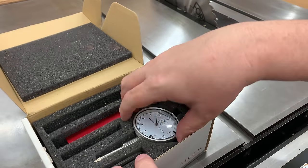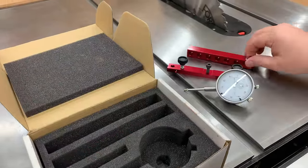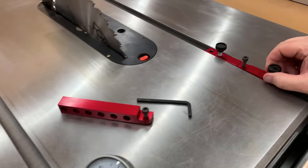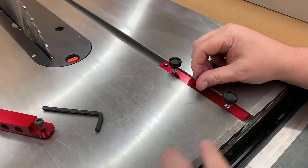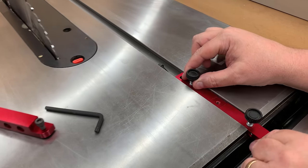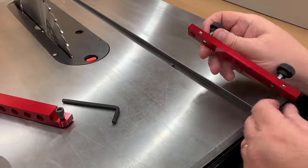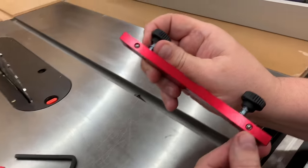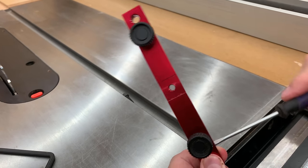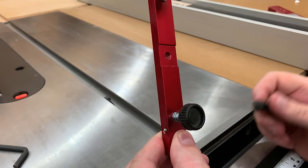I'm going to show you step-by-step how to do this with my particular jig. Mine is made by Alignit — it's a great jig and I'll put a link in the description below. It comes with a bar that rides in your miter slot, and right off the bat it's a little bit smaller than the slot, which is normal — you can see it wiggles back and forth. That's what these little pins are for. There's a screw slot on the other side and we'll screw those out to adjust to a nice fit in the miter slot.